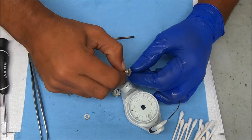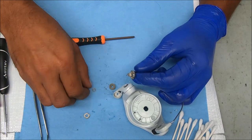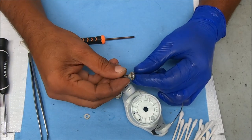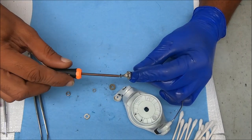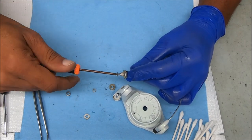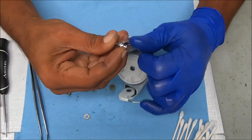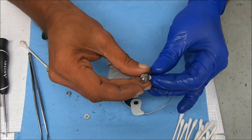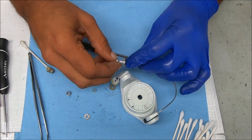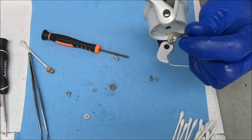Now there are some parts to be careful of — on this post there are two little prongs that's the one thing you can damage, but it's not likely. I'm going to take a vise and open it to about right there. I screwed the screw back in, going a little bit lower, starting at the top just like this — gently press and it pops the post through. If it still doesn't want to come out because everything is frozen, you can extend that screw a little bit and do it again. I turned it with my finger and now it's removed.